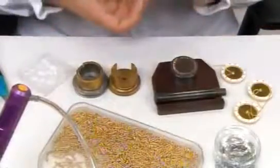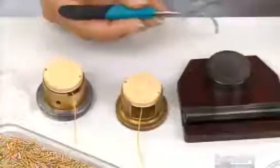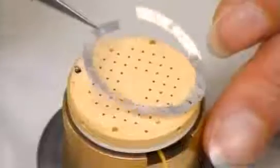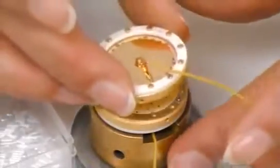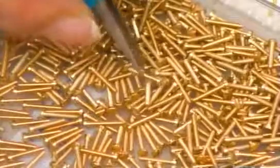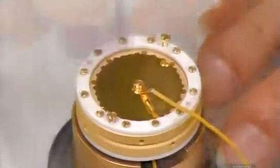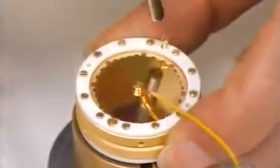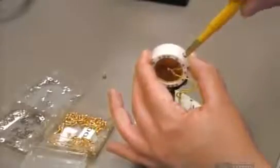Next, she'll join 2 capsules to create the unit that's the heart of the microphone. It converts sound into an electrical signal. An aluminum spacer goes between the capsules, which face back to back. 2 capsules instead of 1 means this microphone can be switched to pick up audio from various directions. A plastic bracket reinforces the assembly.